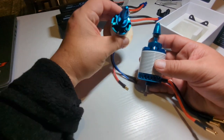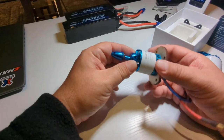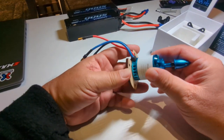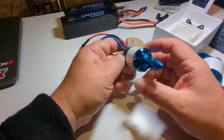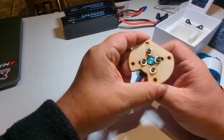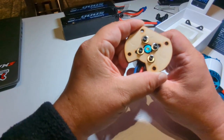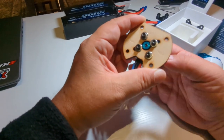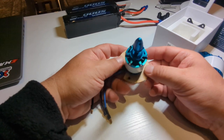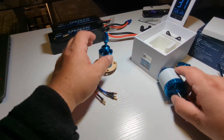They were asking if there was any glue or binding — no issues there. This is screwed into the back of the fuselage with nothing binding. The washers are clear of the spinning parts of the motor — absolutely no issues. I don't know why it burned up other than it's simply not the right size motor. This 3530 is what I'm going to use.